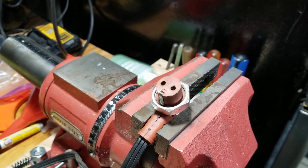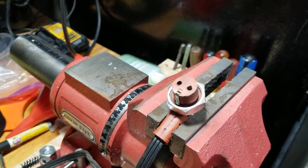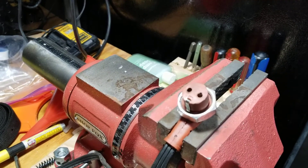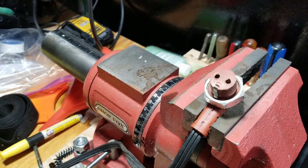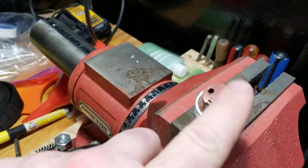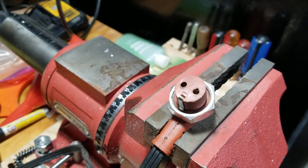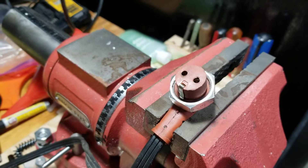I've seen plenty of videos on YouTube about how to replace your core heater and what to check if it's bad, but I've never seen one that explained how if those copper connections in here aren't snug to your core heater element, it could trip your GFI. I've had this core heater cord for two years and just in the middle of January it started giving me trouble.